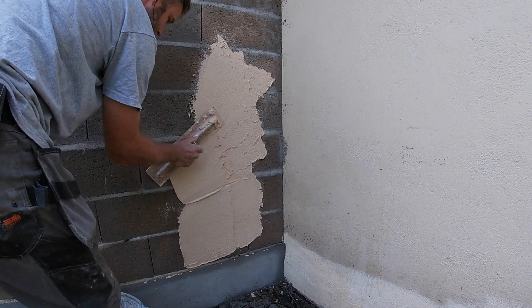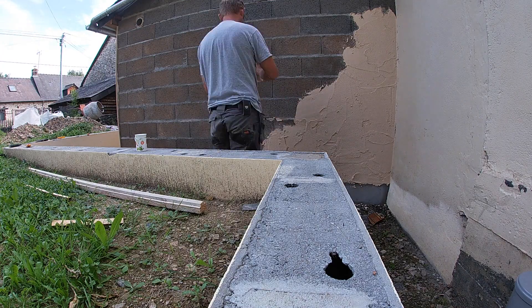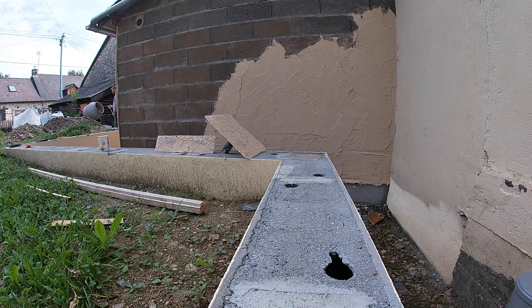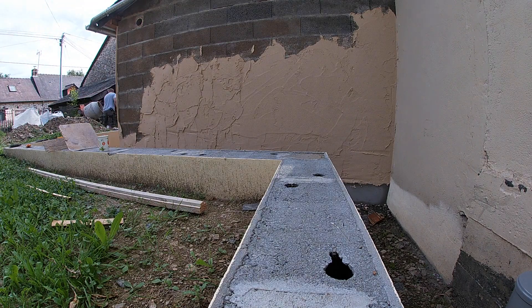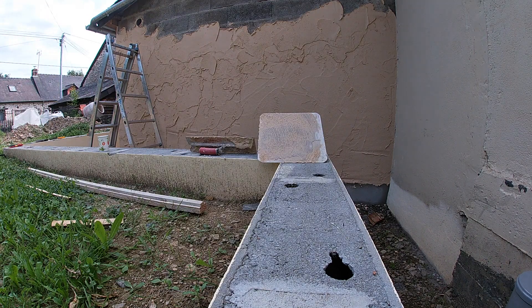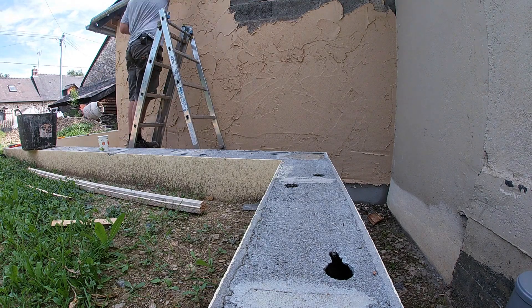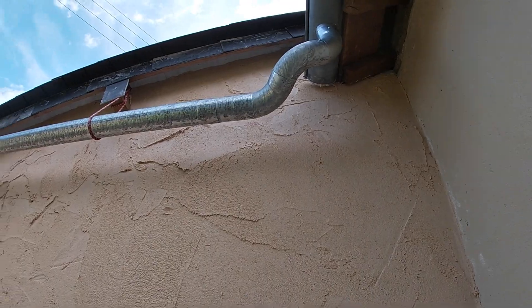If you find it's not sticking, it's probably because the wall's dried out. I've sped it up considerably — I do several mixes in between, drink several cups of tea, and then render right up to the edge. I do everything up to reasonable shoulder height and then do the top bit after. It's worth noting the temperature while I was doing this was about 27-28 degrees. This first coat doesn't have to look pretty.